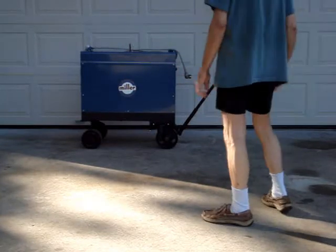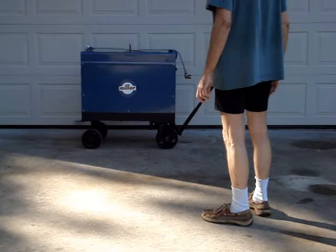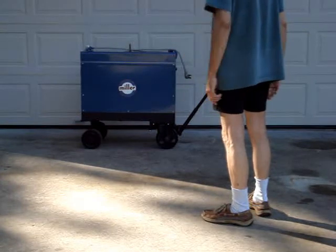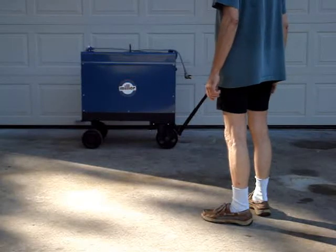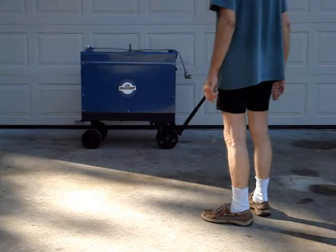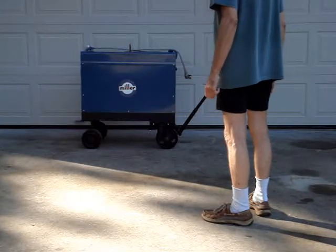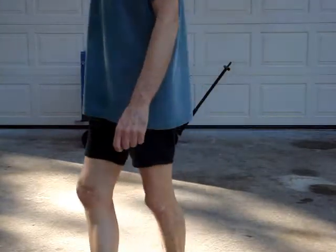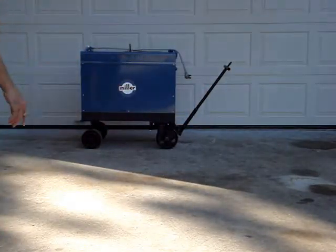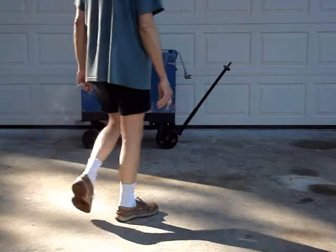I had this giant piece of angle — this giant piece of channel iron, which I think is either 9 or 10 inches wide, and the web thickness is a half an inch. It's what I had, so it's what I used. Obviously it's different iron wheels. I bought the wheels — they were strapped in a junkyard deal. Fairbanks 8-inch on the front, and I think the back ones are about 6-inch. The dial arc's held to the buggy with six metric bolts, because I had a metric tap and metric bolts when I was short on American bolts.